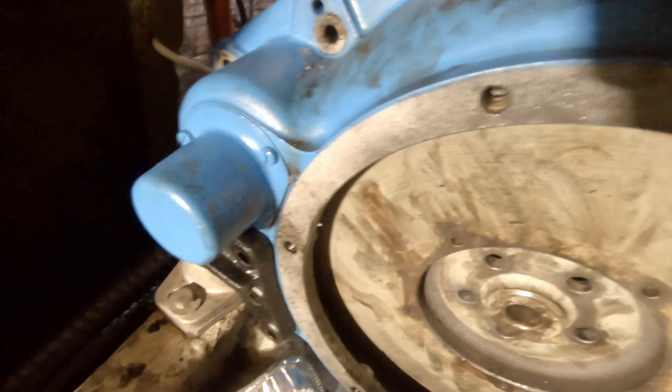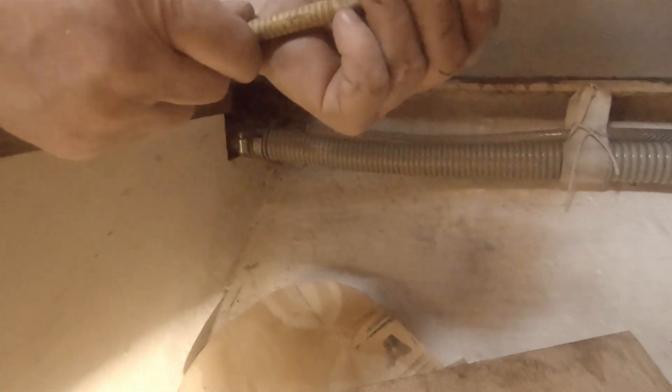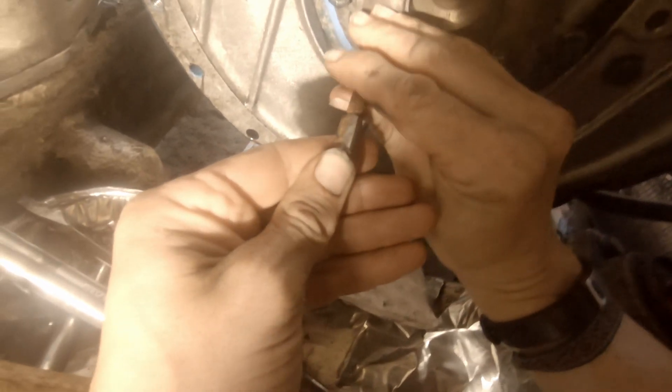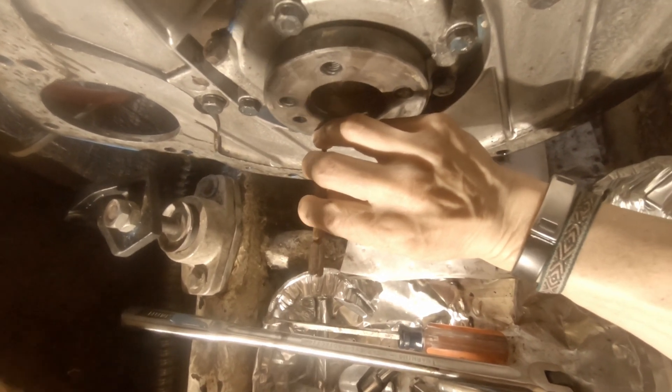Okay, I got one bracket out of the way - maybe that's enough. Probably not. Okay, now we got these three bolts out. There's water in this - that's interesting. I'll have to find where it leaks when I clean up. Found both bolts. I think you just hit it once real good in the center - you can hear my groan of disappointment as I don't leave a good dent for the pilot hole. The bolts are broken at an angle.